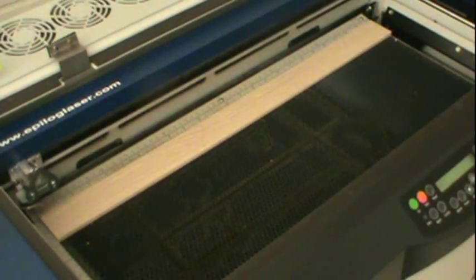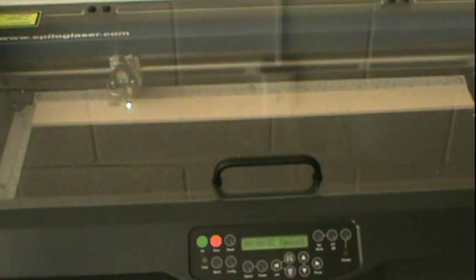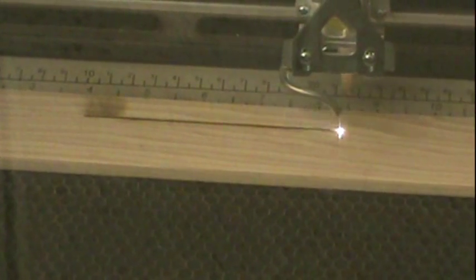Anyway, I'm going to set up the laser engraver, focus it and all that, and I'll show it cutting, and then we'll get into making it. It's actually really simple. All right, we're ready to go. Got to turn on the air. The air is blowing down through a little tube poking down. The air blows through that to keep it from catching on fire. So if you see that first inch there, I forgot to turn it on.